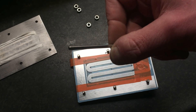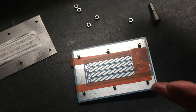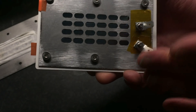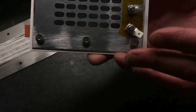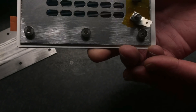They are 3mm thick, 3mm wide, and 50mm long. This one is N52 and the other one is N38. Here are the connections for the coil — I had to drill big holes in this metal plate after the fact that I CNC'd these holes, to be able to attach this. Overall, I could have designed this a little bit better.